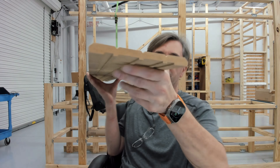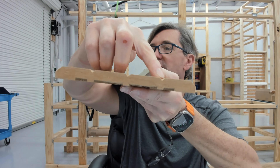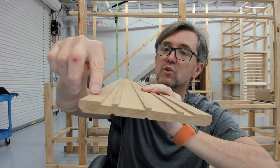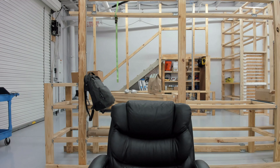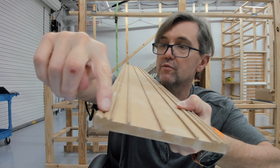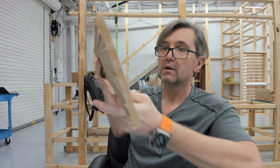This is what that drawing turned out to look like. We put the chamfer on the outside, profile cut it, and since I didn't have the ball bit, I cut a deeper V groove with the 90-degree V-bit. This is what the bottom looks like — no serrations yet because this was just partial work doing the pocketing. If that looks like a threshold, I hope so, because that's what we're going for. This piece is about six inches wide. This second attempt shows the bottom only — this time with the V grooves and pocketing done in the bottom.